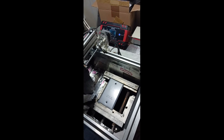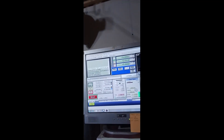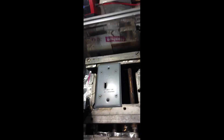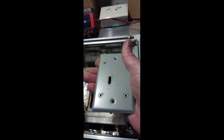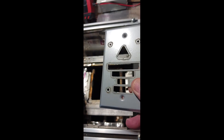Here's my downdraft — I built my setup on top of a dryer assembly — and I'll go ahead and do a cut with Mach 3. Really clean cuts, very little dross, and that's on a painted steel plate. It actually cuts better than the Hypertherm fine cut consumables, and it's just a little cheap Yes Welder.